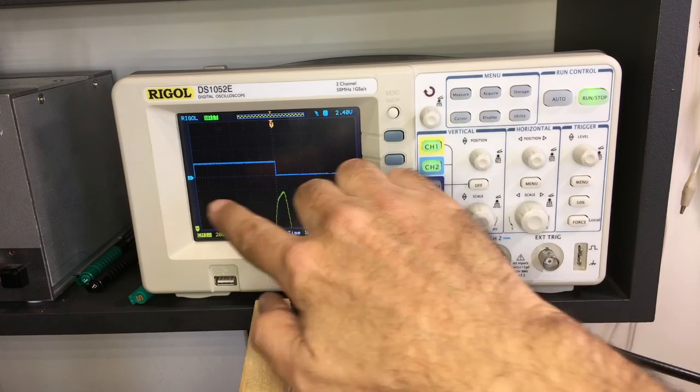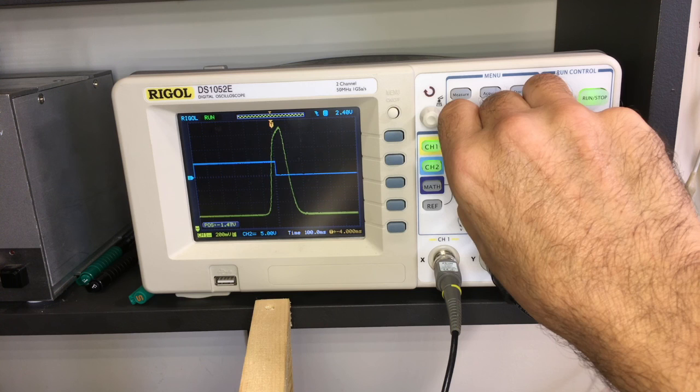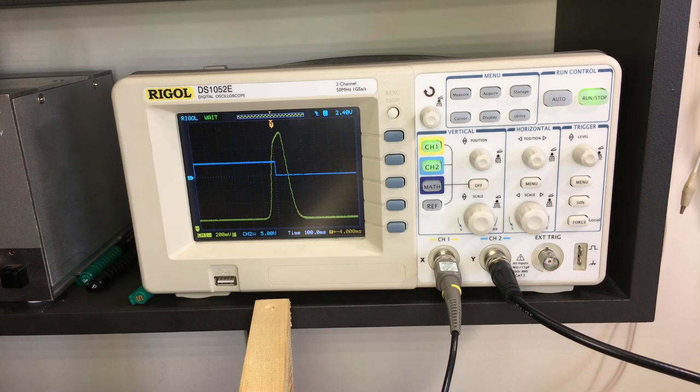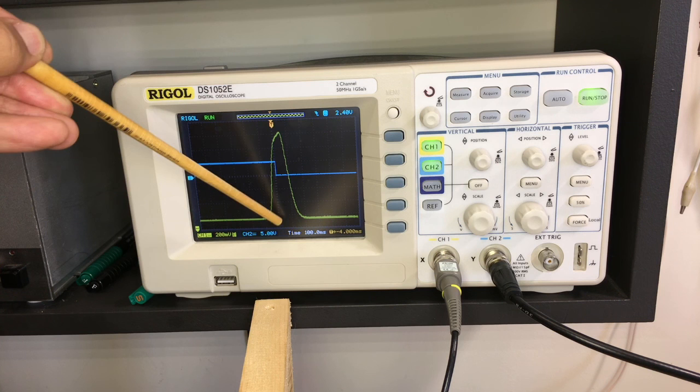And now if I play with the position of this response, here we have it. And what we're getting here is a peak pretty close to the 10.7 megahertz, which is at the middle there. I know this is 9.7 megahertz over here. This is 11.7 megahertz. So the middle, because I've set it as a linear sweep, the middle is 10.7. As you can see, it is slightly off, and I'll explain that in a minute.